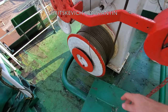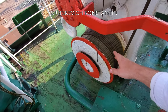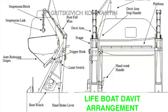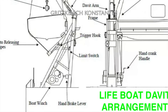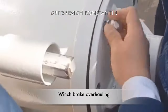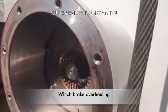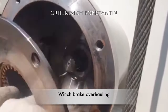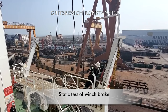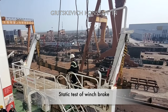Here is the limit switch, the boat wing, and the hand brake lever. The main element of the lifeboat Davit braking system is the Davit winch. If the brakes are not in good condition, lifeboat operations are liable to cause accidents. There are two brakes in gravity-type lifeboat Davits: the static brake, which holds the lifeboat, and the centrifugal brake, which controls the lowering speed.